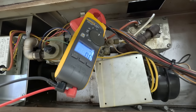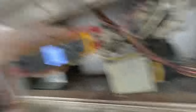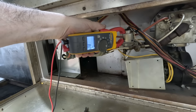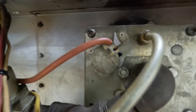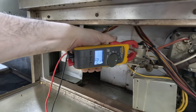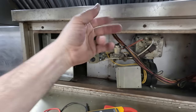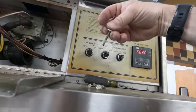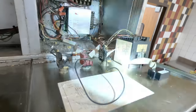There's your solenoid. Technically, it's running right now — that's kind of weird. That's how I check solenoids on everything. Just went out, and the amperage went away. So it's cycling that valve right there. Yep, there it went again. Of course, now it's working perfectly fine — it's cycling every time. The temperature control right here is what's cycling our solenoid on and off.